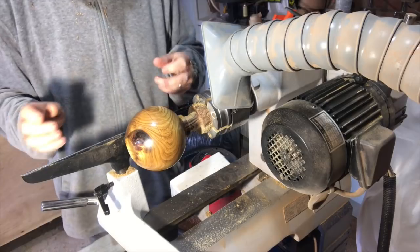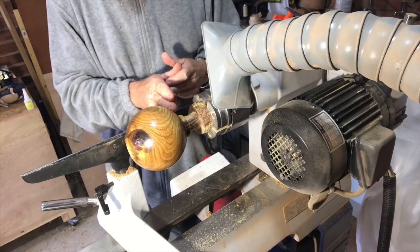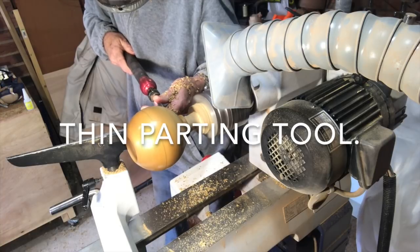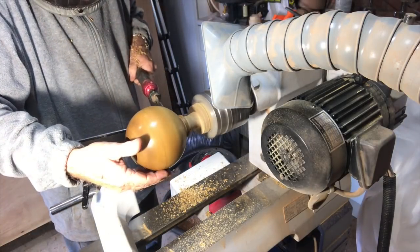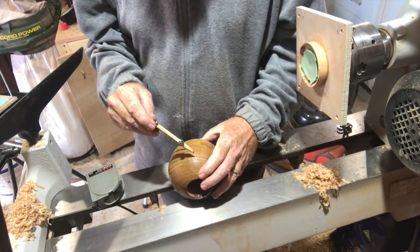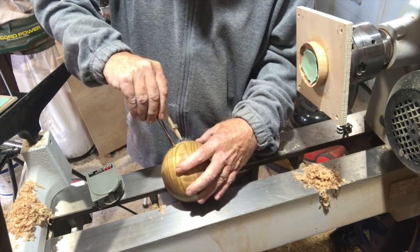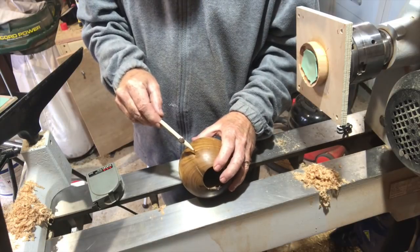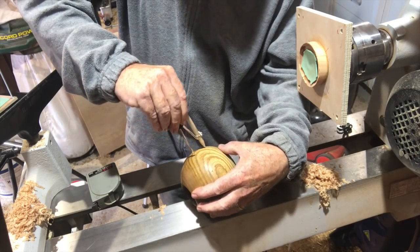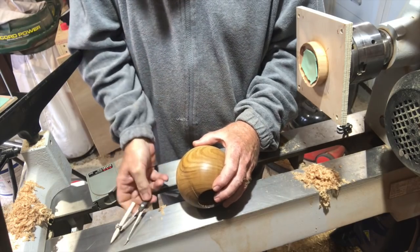What we're going to have to do now is part it off, and we'll do it at a very, very slight angle just so that I can sit on the line that we marked round. If you put a 50mm pencil mark with your calipers, it'll give you two circles. Make sure they just slightly overlap and then we can put it into the jig.